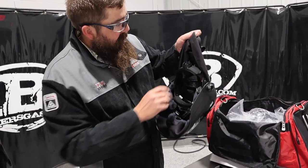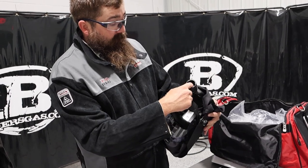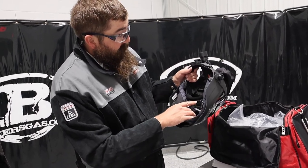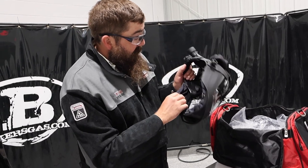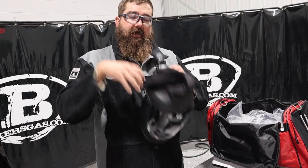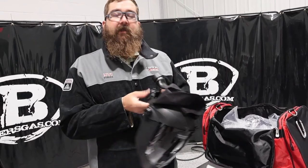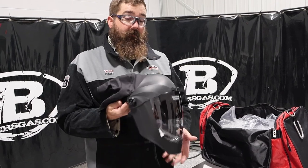Got a little buckle for the back of the head. This is where your hose hooks in. Got your headgear adjustment. Air blows down in front of your face, and remember, it's a positive pressure system — it's blowing air in, sucking it from the back, blowing it in, and pushing out any particulate that you might be around.